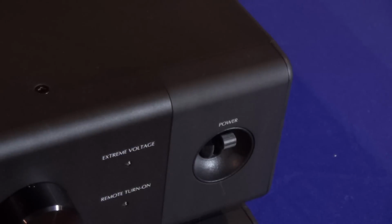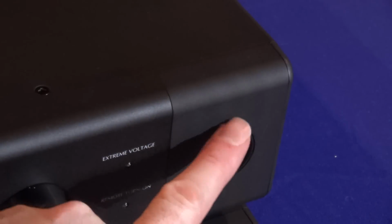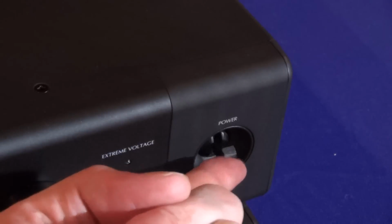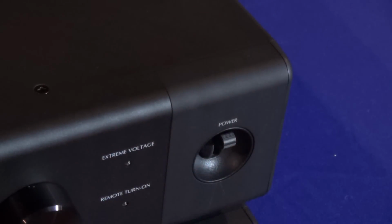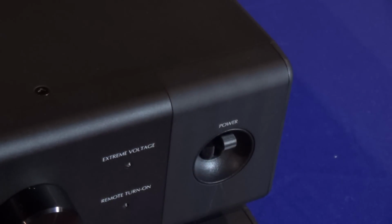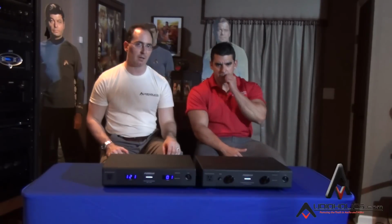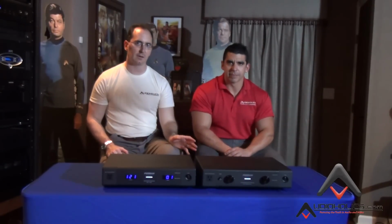What power factor correction is supposedly doing is this: a power amplifier, for example, is an inductive load. It's a motor, if you will. So the current lags the voltage, and you get more reactive power usage and you consume more current. But in reality, the power company doesn't charge us for reactive or apparent power. It charges us for real power, by the kilowatt hour. Right. So if you're buying this product to save on an energy bill, that's BS. I'll tell you right now.